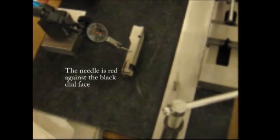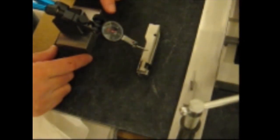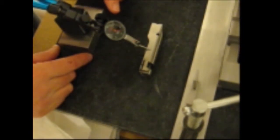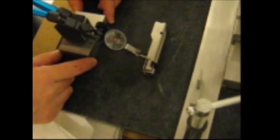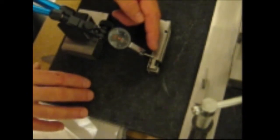This is a slightly different sweep setup. I now have the bolt laying on its side and we're going to check the precision of the stock bolt over this side. This indicator is a little different — it only reads out in increments of 5 ten-thousandths of an inch, which is half of one thousandth of an inch. It's a pretty accurate indicator. I have it zeroed here — it's at the 6 o'clock position. If the surface rises, it'll go clockwise; if the plane drops, it'll go counter-clockwise. When I set it up on my surface plate and enter at the charging handle groove, it pretty much goes almost to the 15, which I consider the zero point.